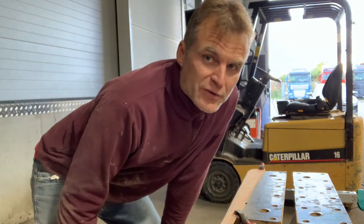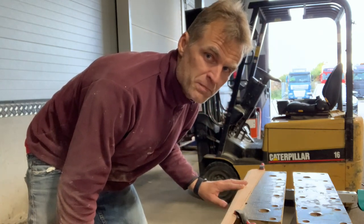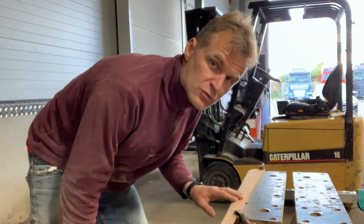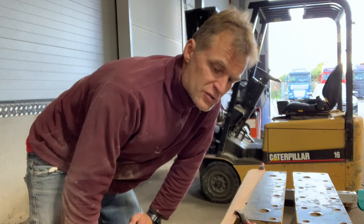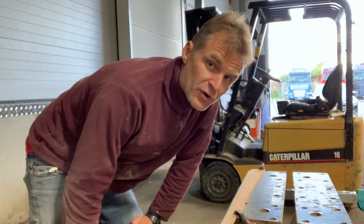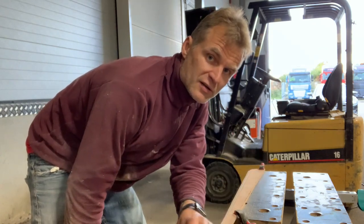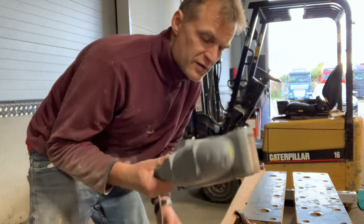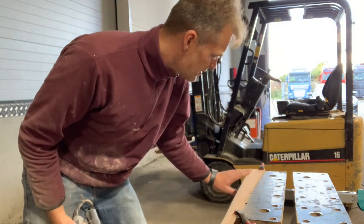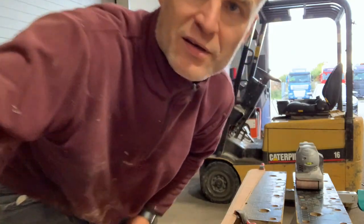What I'm doing, I'm creating a scarf joint for the plywood panel. The half bulkhead, which was not level, needs to be extended from the top, one side a little bit wider and the other side a little bit less. And I'm using just a belt sander to do this. First time ever I'm trying to do such a thing, and let me show you.